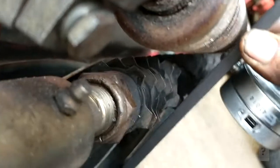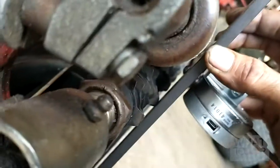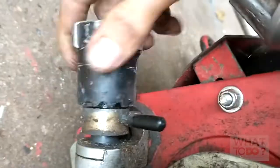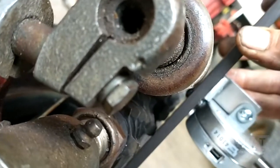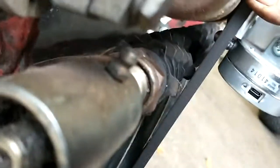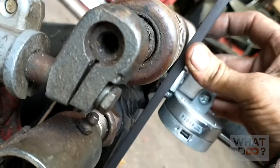Let's check it now. That was a lot of turns — see, now it's hitting and I'm not resting on the top roller, so that's too much, we need to back that off a little bit. Pull up and go the opposite way to back it down, then check it again. We're still off of that top roller because now it's hitting the groomer — got to take it in even more. There we go, so that's just touching the level and it's also on the groomer.